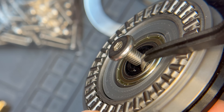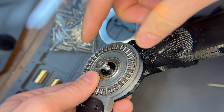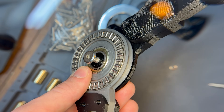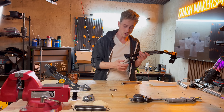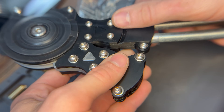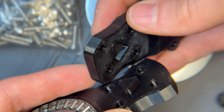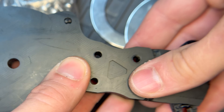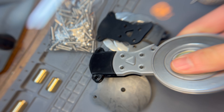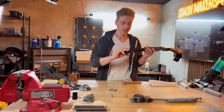The axle sleeve does two other things: it houses a bearing so there's no friction from pushing on it, and it mechanically isolates the bolt from rotational movement, because these joints go through hundreds of thousands of cycles. Without complete isolation to the main bolt, over time it would loosen the nut and fall apart. The hinge also has extrusions that mechanically bite into the upper piece to add strength from shifting — the bolts hold it down but these positive and negative insets are what hold such a tight connection, showing impressive strength improvement when made from metal.